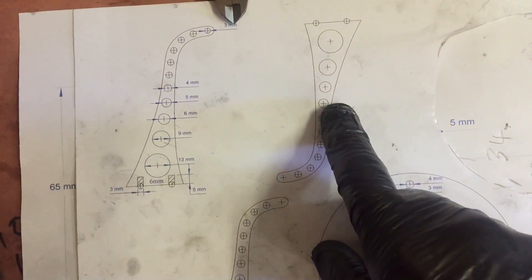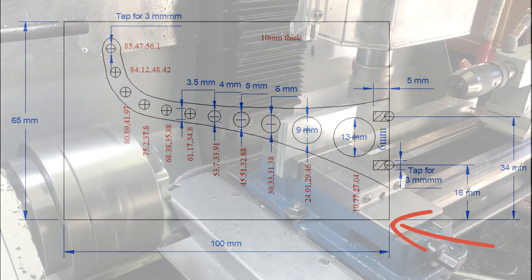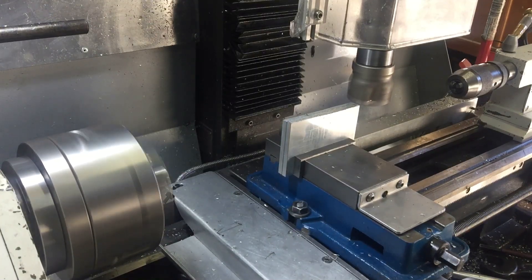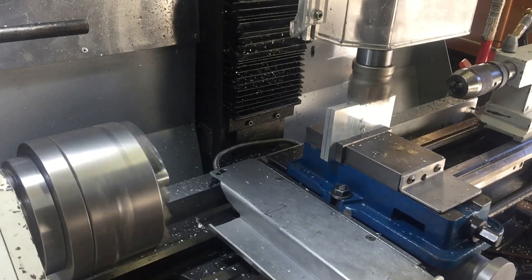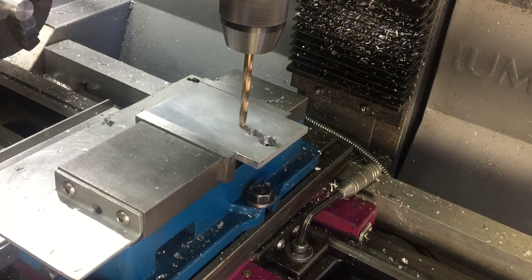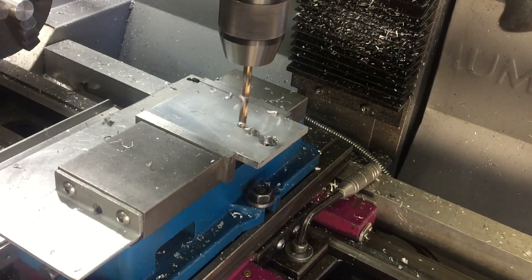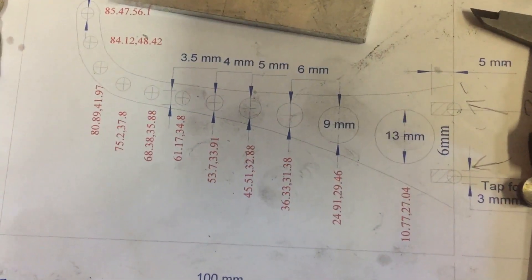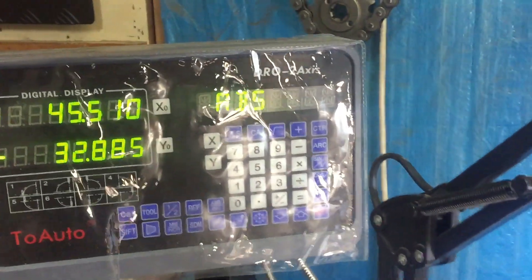The tensegrity plinth has two arms, one from the top and one from the bottom. It's got a number of holes in it — they're all different diameters — so to get the holes in the right place I've got some XY coordinates that I can use with my DRO, with size zero on that bottom right-hand corner. I've got to prepare the blanks and I'm using two 6mm pieces for this. Using the DRO, I can get both of them in the right place, both arms the same. I set the XY on the DRO and I'm ready to drill the next hole, etc.